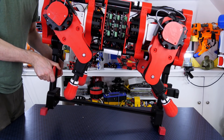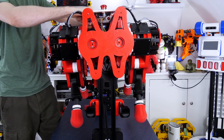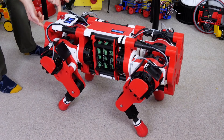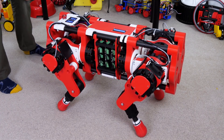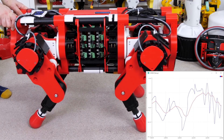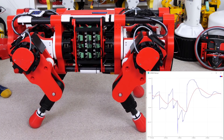The first thing I've done is made the translation axis respond to the IMU in pitch and roll. As I tilt the robot, the legs move in the direction the robot is moving so it keeps its weight above the legs — going up a hill it leans in and puts its legs behind it, coming down a hill it puts its legs in front. The problem with this positive reinforcement reaction is oscillations: if I shove the robot it wants to push its legs in front, which pushes it the other way, and the IMU data feeds back again. So I've used a first-order filter — the red line on the graph versus the raw blue line — which is much smoother, averaging out spikes, and damps down nicely within one to two oscillations. It probably needs some further tuning but we don't get that massive ongoing oscillation.